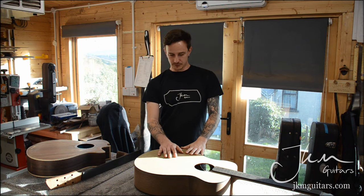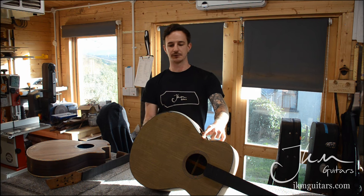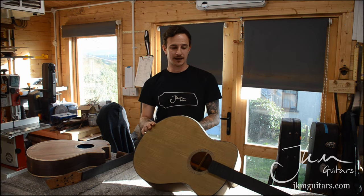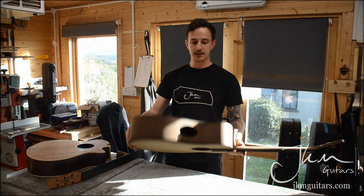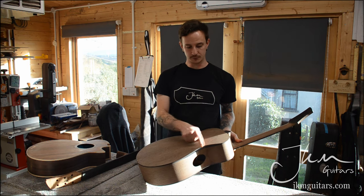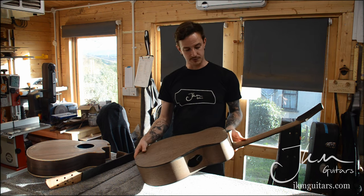The reason they took a lot longer than I expected was the additional bevels. These were the first time I was doing these kind of slimline bevels, so they ran quite a lot longer, but they're only about a centimeter deep. Working out that process took a bit more time than I expected. And then the belly bevel — that wasn't too bad, thankfully, without the purfling on the back, and to tie in it was actually quite a simple process.